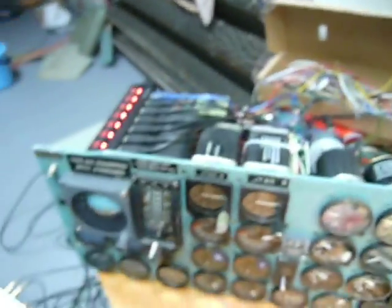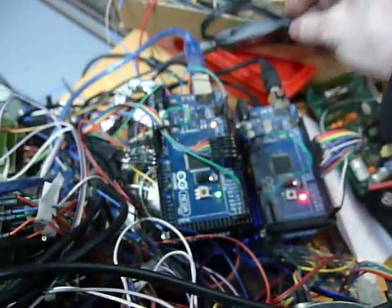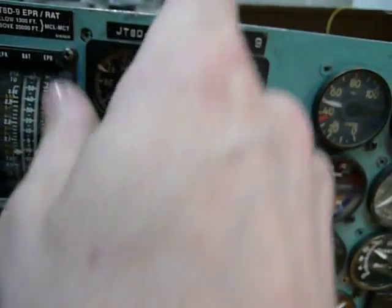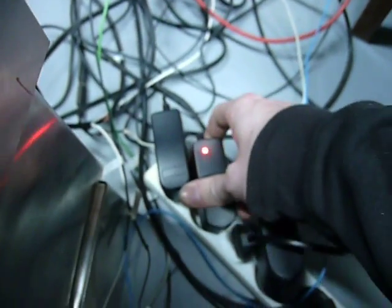So these controllers are no longer running, and I can now remove the USB cable from the hub. That's the 7 Arduino. And one more USB from the 8 Arduino, that's 7 and 8 here. And you see, these Arduinos are still running and still showing something, with the exception of these two. That's the extra cable that I removed. But all the others are powered from the hub, so I will need to remove power from the hub and the 5 volts in general. Now all the instruments are dead again, and now I'm able to put these two power supplies back, and if I'm successful, I should be able to restart all the controllers.